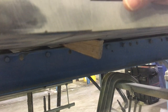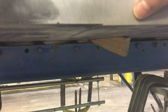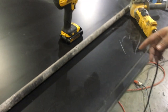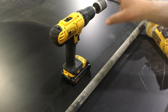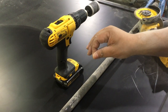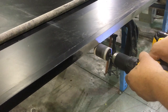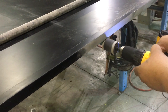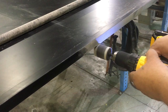Whenever you have to sand the difference and feather it to make the thickness tolerance correct, there's three different methods that you can use. You can either use a cordless drill with the sanding drum. This would typically be used when it's a 32nd or a little bit greater than a 32nd. You can come underneath and just sand the bottom of it, going back and forth, and take some of that off just like that if it's not a lot.